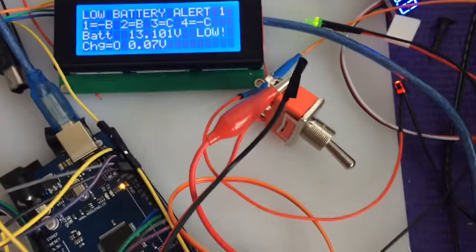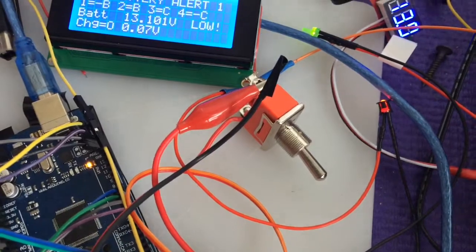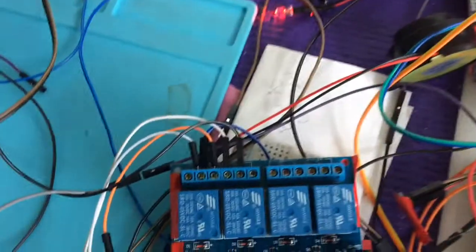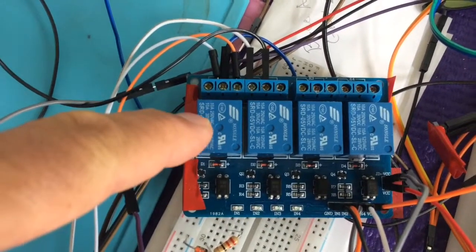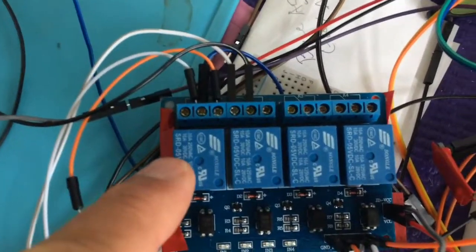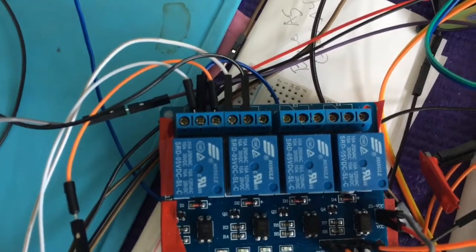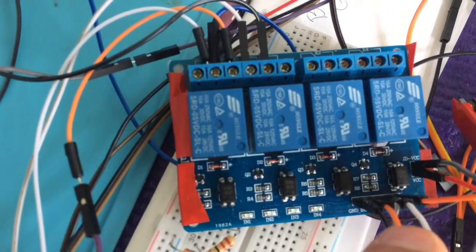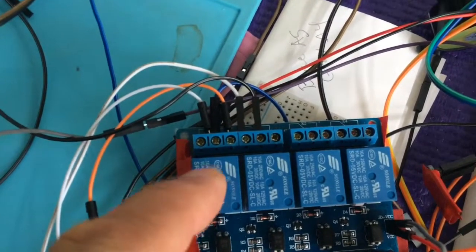In the simplest form, a relay is just like one of these switches that I have that I'm turning on all my bench with. But then they've evolved to this sort of thing, a relay module, and it allows low voltage signals to trigger a switch capable of handling a very high voltage. These are the very low thin wire DC connections, and we use that to trigger something on the outside.